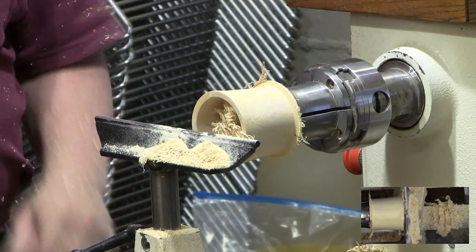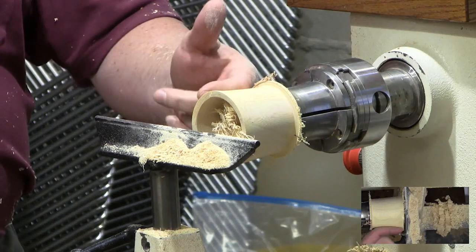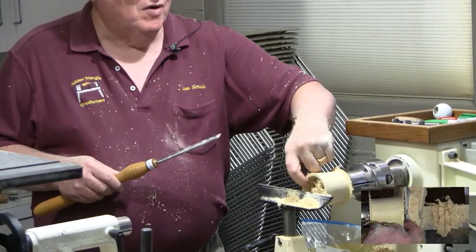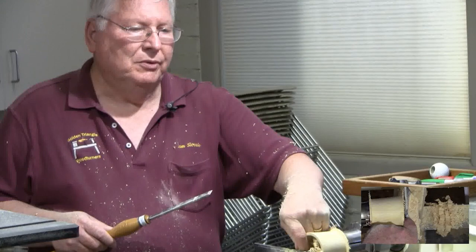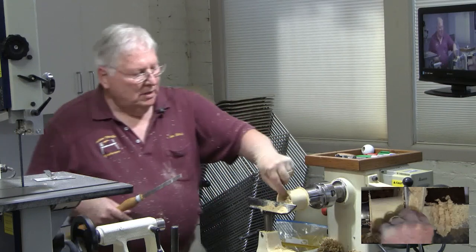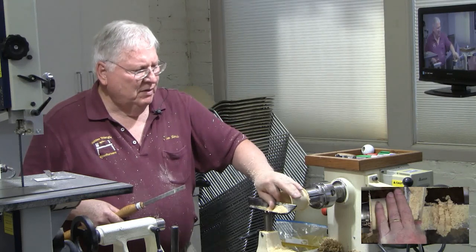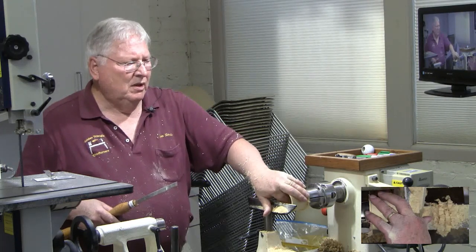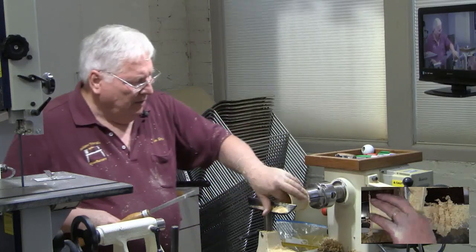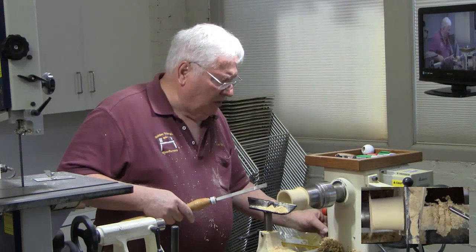The reason I like this small skew is as you're coming along the inside of this radius, it's small enough that it doesn't interfere and drag. I've looked at some of the carbide tools, but the base on those is so far down that you're rubbing the base before you get to the edge. Some of the newer pen tools have a cutter head much wider than the underlying base, and those can work for that activity a little bit more.